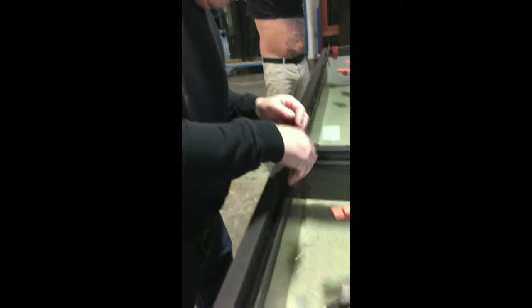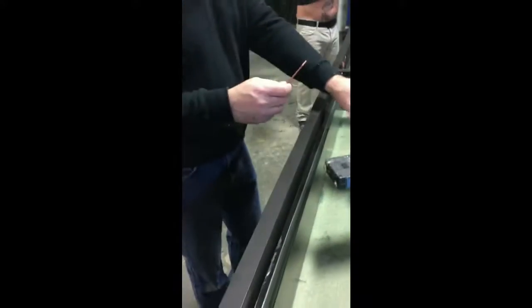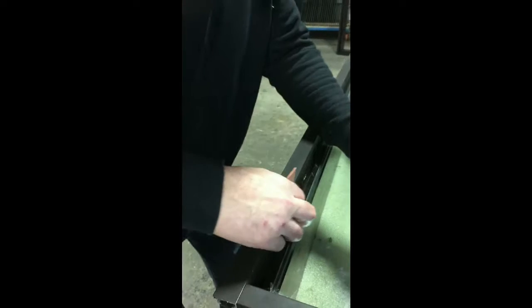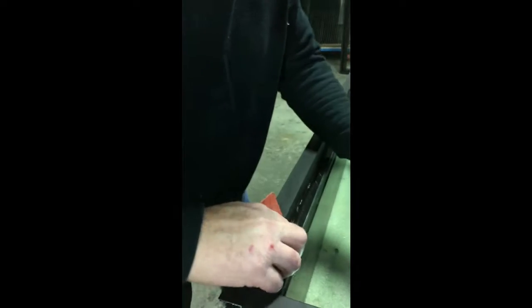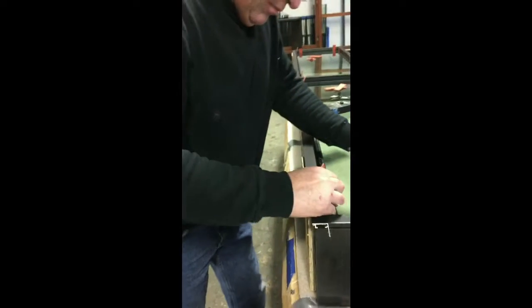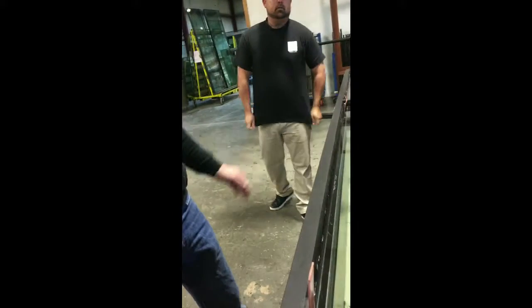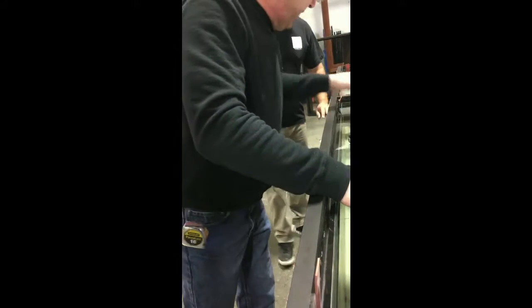The glass can be a little small; the opening can be a little bit big. Do you always want more shims at the bottom than at the top? Well, at the bottom, if it's really big, then we gotta go with more shims. If it's super wide, but this isn't super wide. And a glazer too — if you got a glazer there, it's just a feel. It's really just a feel.